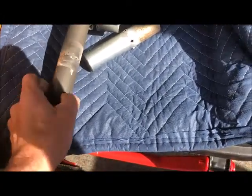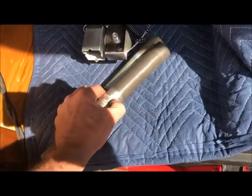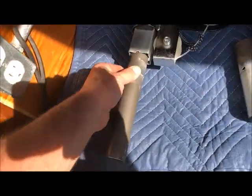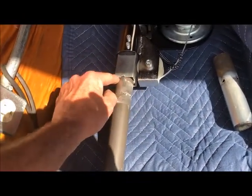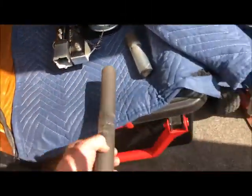What I'm doing is I'm grinding this one off. I got a buddy of mine that made me some pipes — these are much longer. I'm gonna take these, clean up those welds, put that in there about here, so the whole length of this one will be in. Then I'll tack weld just like they did here, drill holes so far down, tack weld on both sides, and grind it flat. That's what I'm gonna do.